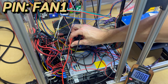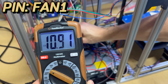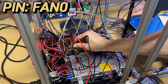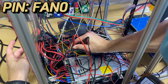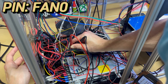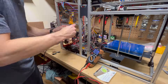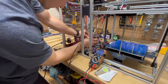My curiosity wanted to see if this also happens to the main fan 0 slot used for cooling prints. When I measured fan 0 before the heater was turned on, I had a reading of 11.67 volts. Then when I turned on the heater bed, the fan 0 pin output drops to 10.89 volts. This seems to be a common thing across the fan pins — the voltage drops when the heater is turned on. For these lights, I need a more consistent voltage supplied without any drops to avoid flickering.